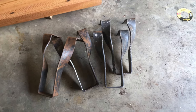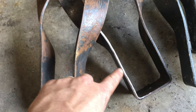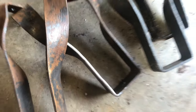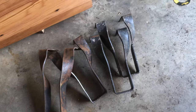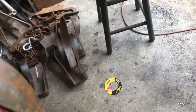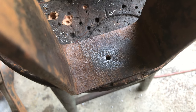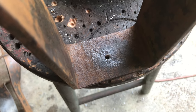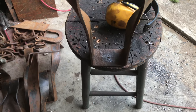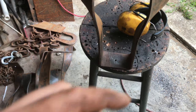My two piles have been wire wheeled. I've got that stack there and that stack over there. This one had some kind of sharp edges on it so I had to go over it with a grinder to take those off, but other than that we are pretty much ready for paint. I'm going to tack on a nut right inside here — I'm going to put an adjustable foot on there. So I'm going to weld a nut on the inside. It would be stronger if I welded it on the bottom side of the foot bracket, but I want them to be able to sit as flush as possible, and if I put a nut on the outside that's going to stack it a quarter inch or so.